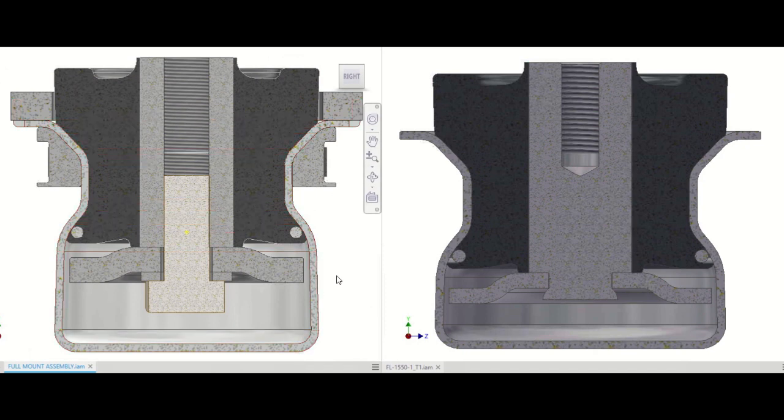The big difference between the original and ROPS version was the addition of the collar and reinforcement plate. The collar was added to help strengthen the middle section of the mount to transfer the load from the damping plate to the top of the cup. The reinforcement plate was added to strengthen the top of the cup so that it does not fracture as the collar pushes upwards.